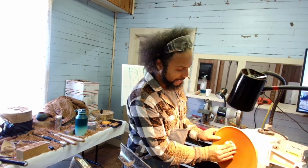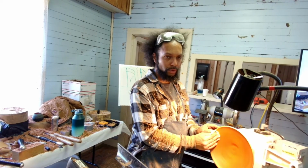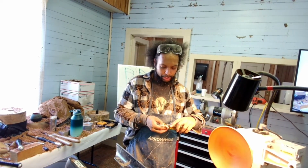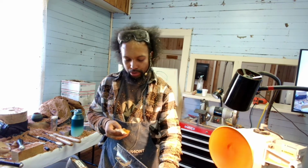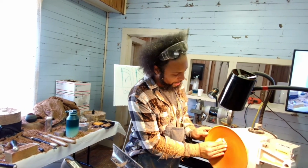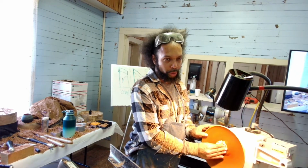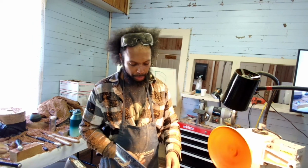Is the oil going to protect the wood from absorbing the liquid and cracking down the line? Well, that's more commentary on the inherent moisture level. For anything like that, you'd be better off with a roughed out piece. You want to rough something like that out from green stock first, then wait about 6 months. You need about 6 months.